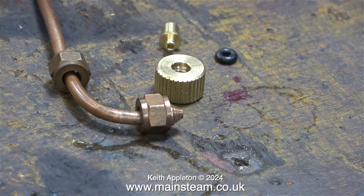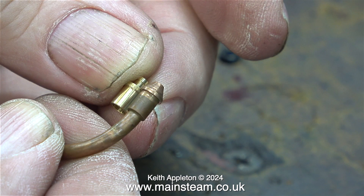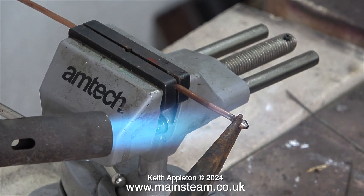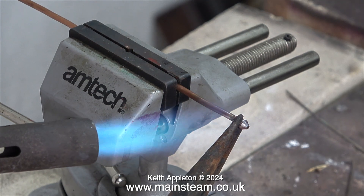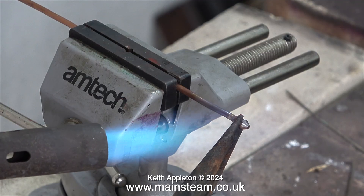That's it for the gas tank — it's full. Now I'm going to tackle this job by unsilver soldering the existing coned union on one end and then fitting this one. It's easier to remove the old union cone by simply heating the area to a dull red and removing the union cone from the end of the pipe.